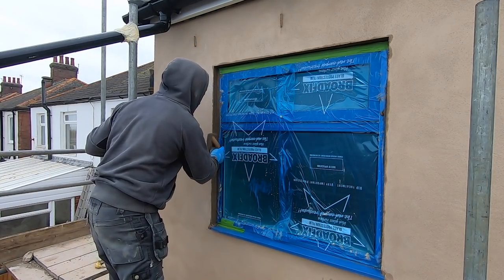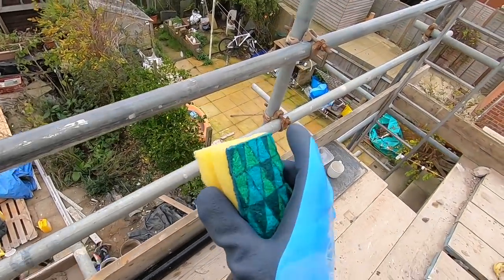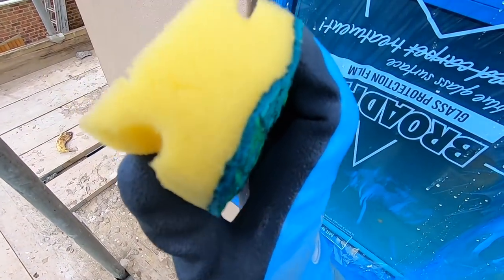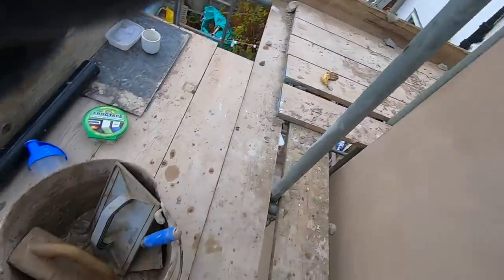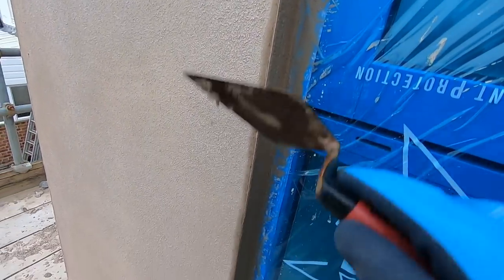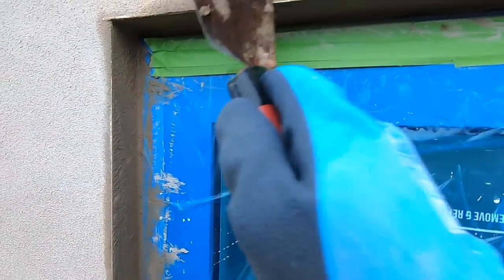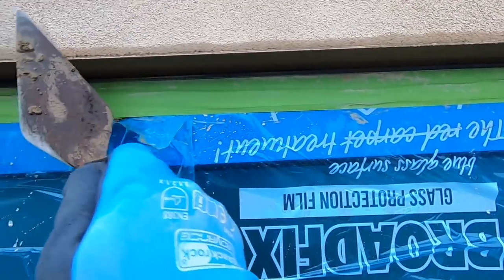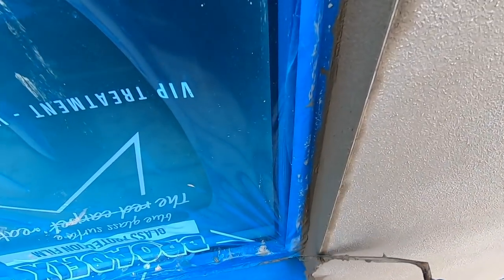After these reveals you don't want a big sponge. I've just gone for this — it's just a square sponge, but it's perfect because the square edge you can use to put between the joins of your top reveal and your side reveal, so it is just perfect. Now the first thing I do — I've always got one of these — grab your little margin trowel, clean the edges of your beads first, just get that out of the way. Tops, sides, everywhere — just clean them off.